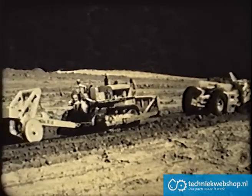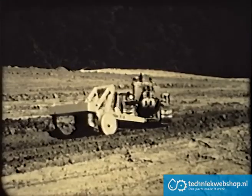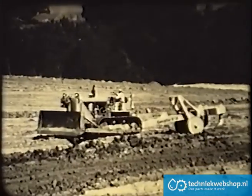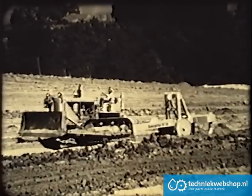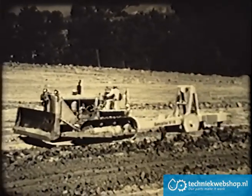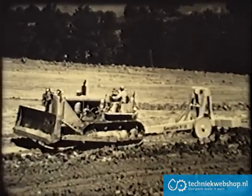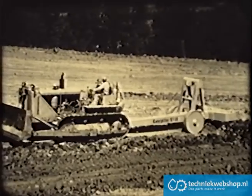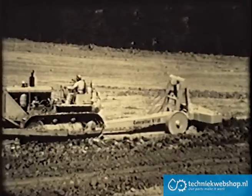Or the tractor can be equipped with a ripper to loosen material yet to be loaded. The Number 18 ripper is built to utilize the full power of the D8 tractor, and the Number 28 has the strength to stand up under the pull of two D8s. Both rippers are regularly equipped with three teeth with replaceable tips made of heat-treated alloy steel. On extremely tough conditions, where rock, shale, or heavy gumbo may be encountered, it is easy to drop one or two of the teeth, concentrating the full power of the tractor on the remaining teeth to break up the most stubborn material.